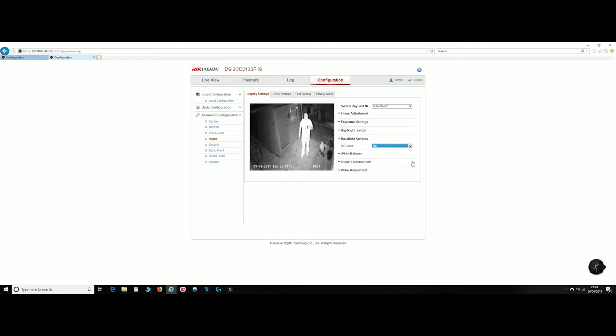So if I wanted to identify the face of anybody, say, breaking into my shed or whatever, I would be struggling because that light is so bright. So you're best actually illuminating it like I've done now. You'll see it looks quite dark on the shed itself because I've set it to, I think, left instead of center or top, but on the person it's much better. It's illuminating me much better.